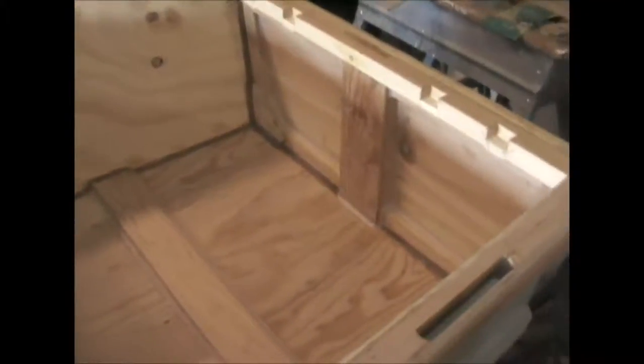My cabin area is all coated with two coats of epoxy primer. Now I'm preparing the stern storage compartment for resin and glass. I've got my deck support pieces in there and I've got all this filleted. I added a piece of plywood there to bolt the rudder mounts — the rudder gudgeons — because rudders take a real beating on these things.